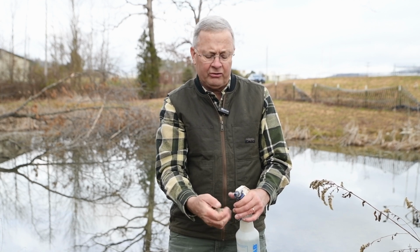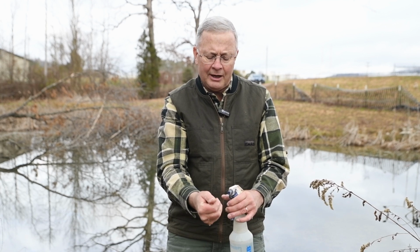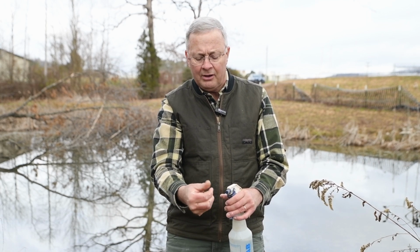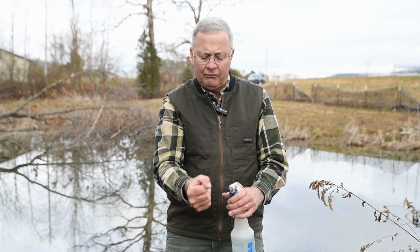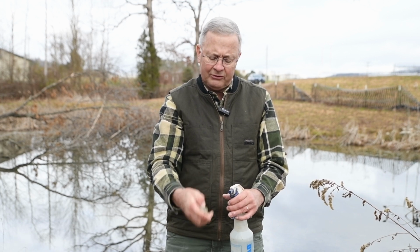It takes a long time to work water into bentonite. And this is something to remember on a wetland project. If you want to use bentonite, it's very difficult to mix water into it because it's very sticky. It will stick to all your equipment, and it takes forever to get that water mixed in. So here I've been mixing the water in and mixing the water in.